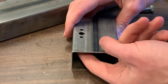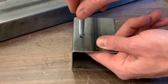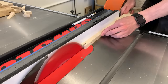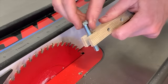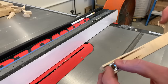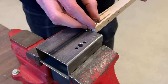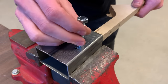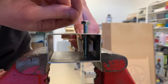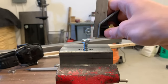Now we need to put the nut inside and secure it with a bolt. If we were doing this in the middle of a long tube, I can't reach in and place the nut like that, so we're going to have to make a tool. I'm using the table saw for this because it's a tool I have and am comfortable with, but I'm sure there are other ways to make this little wrench. This slot is just wide enough to hold the nut and keep it from turning, and the clearance below it allows the bolt to pass through.